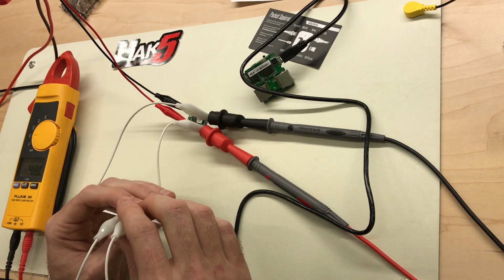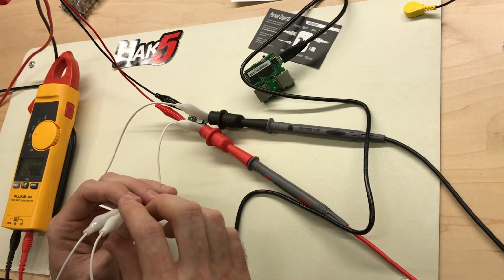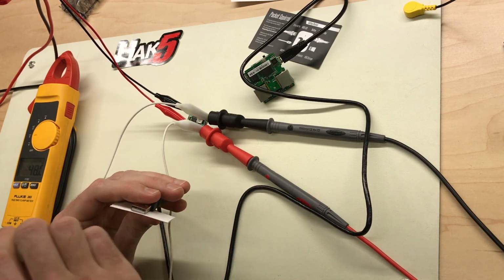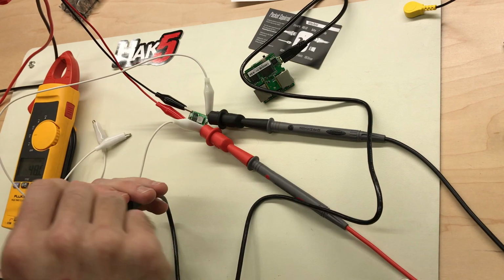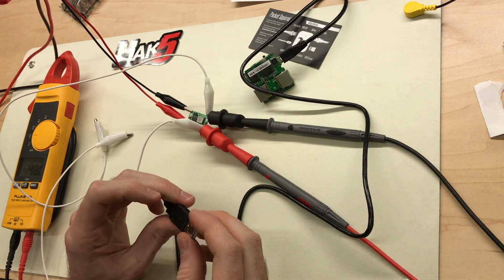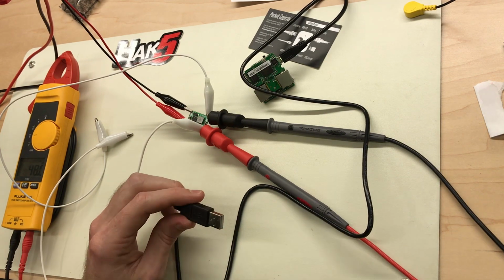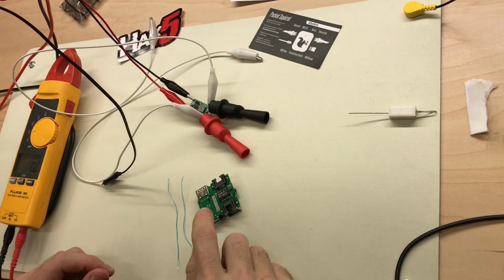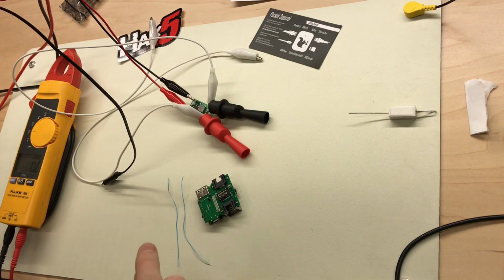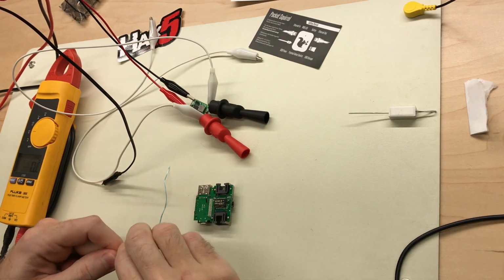I think I'm just going to go ahead and solder power onto the board, since that's where we're going to have to be anyway. I got this working earlier with just regular 5 volts in to make sure I could do it on this, but it was a little tricky getting the wires lined up like this. I don't have a female version of this, so we'll just put some power wires on the Packet Squirrel. So I've marked the negative lead on this through-hole USB connector just to make sure I don't get mixed up with all the board flipping and twisting and turning.